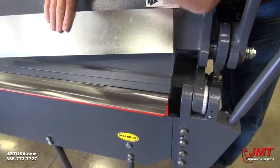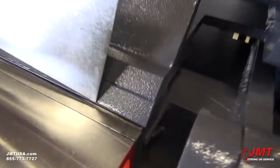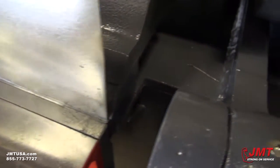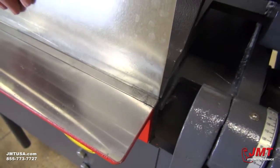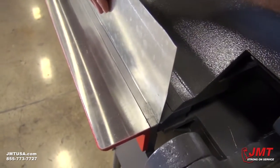So we're going to make an adjustment here. Right here is our bend line, and then this is the edge of our braking. We can see that there's still a fair distance between the bend line and where the material thickness is at. So we're going to adjust that in to match our material thickness.